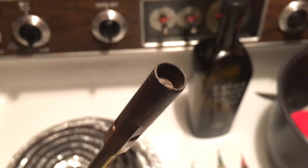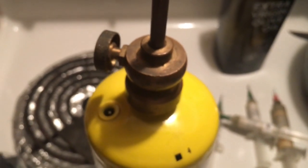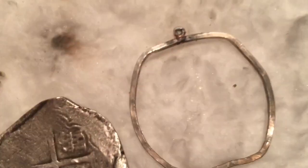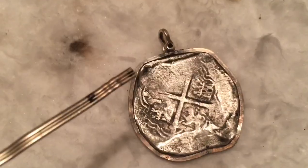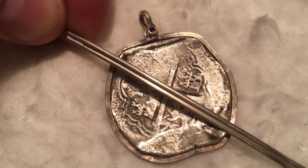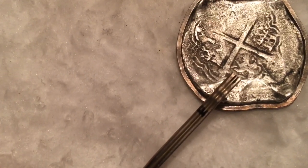Torch-wise, I'm using a Bernzomatic pin torch — works really nice, I think I got this at a swap meet for two or three dollars. I got the little doughnut soldered on there; it doesn't look great right now, I need to do some filing. The doughnut part itself won't be visible — we're going to have a shackle bail going there. The top two clamps will be medium, medium, then soft, soft on the bottom. I'll clamp the top two most of the way down, and leave the bottom two a bit open so the coin can fit in, then close them with pliers. I don't want to harm this coin in any way.